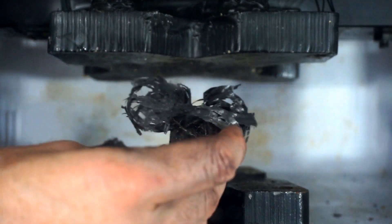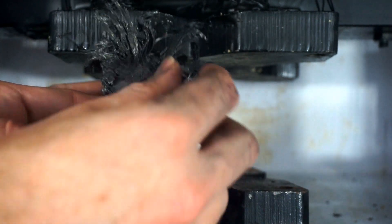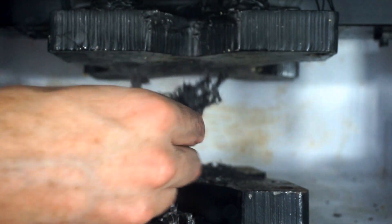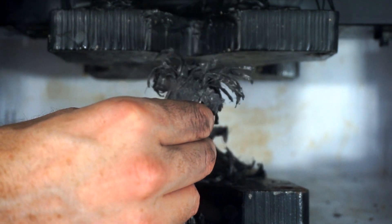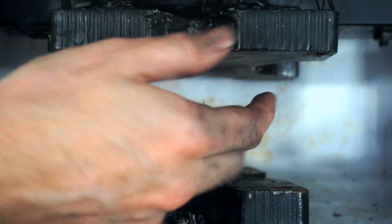So what this is called is delamination. The fibers actually just delaminated — they didn't necessarily fail catastrophically, but they just delaminated and unpeeled as it came down. I didn't expect that to happen. I've crushed carbon composite before and it usually has an explosive result, but this just kind of peeled down.